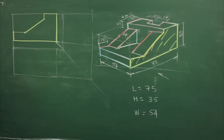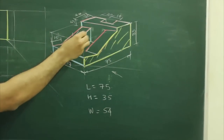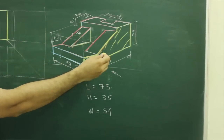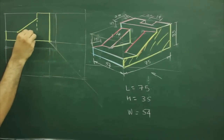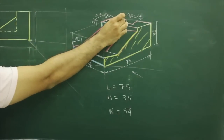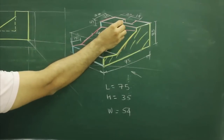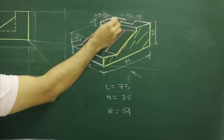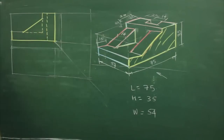Then if you see in front of you, you will be able to see this part. If you see carefully, you will be able to see this triangular part, which is hidden from the front side. So we will draw that as well. After that, there is one more thing — that is this slot, which is going through and through. So there will be one more hidden line, one more edge going through and through, which you can't see from the front side. We need to draw that also — from here, take 12 and draw 10.